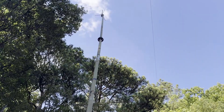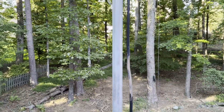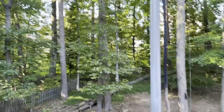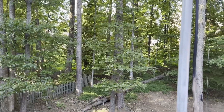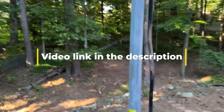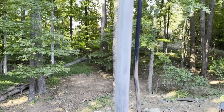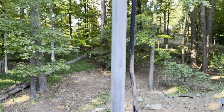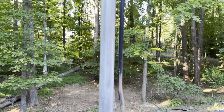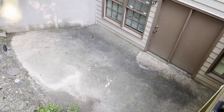I did not reattach the guy ropes. You can see where the guy ropes can go, but they really haven't proven to be necessary. In fact, the one time this antenna came down was when a limb from a tree fell on the guy rope and pulled the antenna over. Where it bent, it didn't bend on the steel sections — I had some copper-colored aluminum sections I bought at Lowe's, four and a half feet long. They were the weak point and it just folded over, winding up laying over by the door to my shack. And yes, I need to pressure wash that patio.